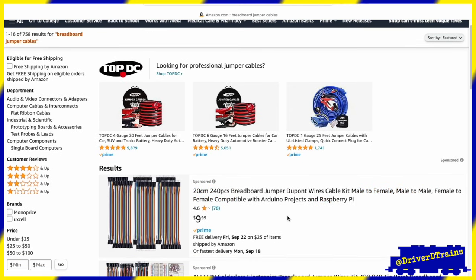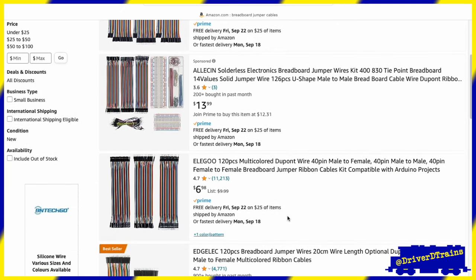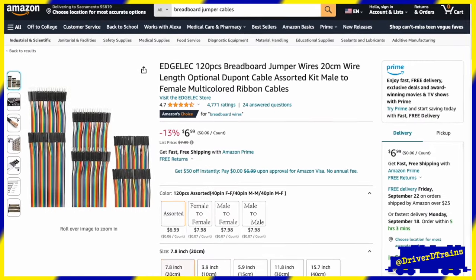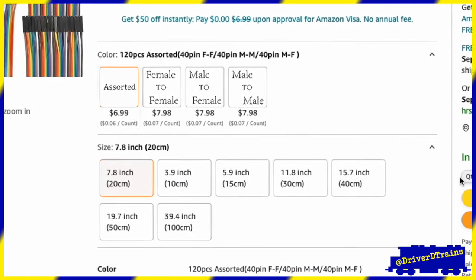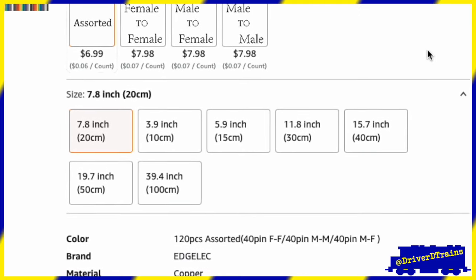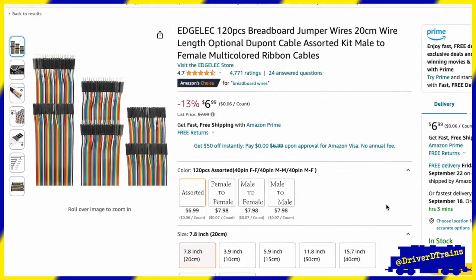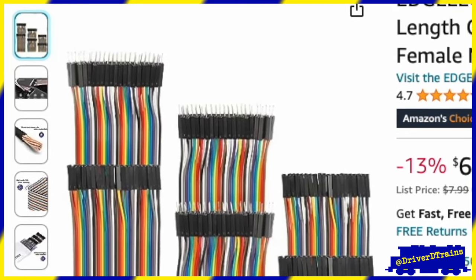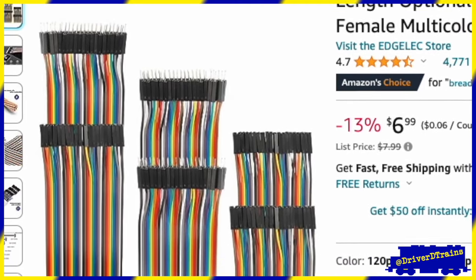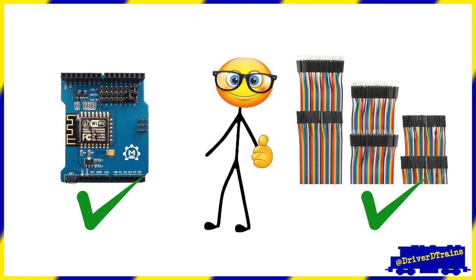In addition to the Wi-Fi Shield, you will also need some breadboard jumper wires with male and female ends in different configurations. You can find these on Amazon in various links. The 20cm or 7.8-inch ones work well. I recommend you purchase a variety pack, like these shown here. You'll only need two male-to-female wires for the Wi-Fi Shield, but you will need some female-to-female ones for the LCD display we'll discuss in the next video. Again, I'll include a link in the description. Those are all the parts we'll need for now.